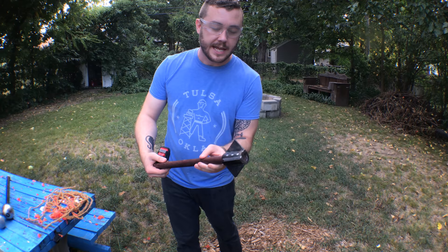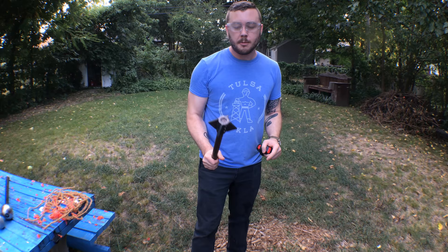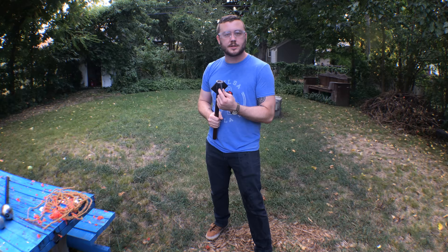This is the first one we made. It's quarter-inch thick steel plate that Screep cut up and re-welded into a flanged mace. I love the flange mace - it's on a pretty small, I think three-quarter inch thick oak dowel, but it's just the right length. The idea of a flange mace is that it localizes the force into one of these flanges and just cuts in like a can opener right through whatever you're hitting. So I have no doubt this thing's going to obliterate a coconut.